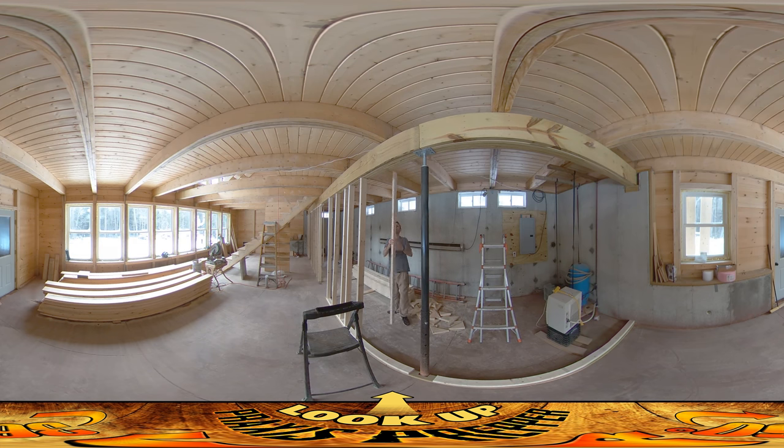The way that I do that is on the bottom I have both the sill and the header of this wall. One of these boards is going to be up at the top and one is going to stay at the bottom, but I have them both down there just to account for the thickness of the boards. Once I get everything measured and cut to the correct size, I'm going to take the header and move it up to the top and assemble it that way. But for now it's easy just to have them stacked on the floor so you're accounting for the thickness of both the bottom sill and the top header.